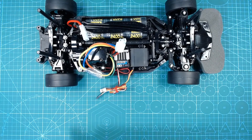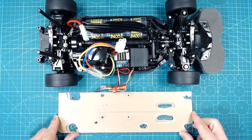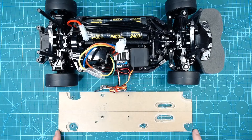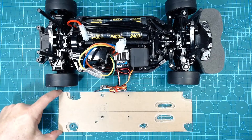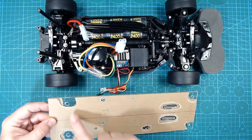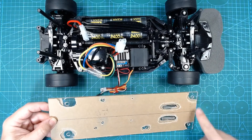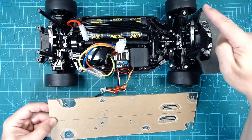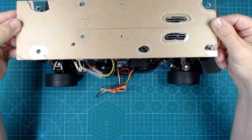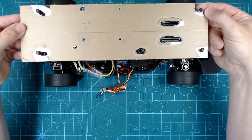I've cut out a piece of perspex. This is 4mm thick, 300mm long, and 90mm wide. In each of the corners, I have drilled some holes that align with the body shell mounting poles. This did take some trial and error to get them to align, and some further refinement with the file.